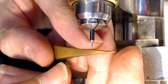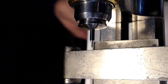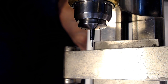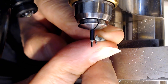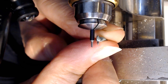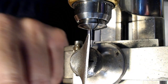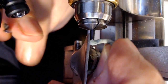So, I dropped it, but the good news, it's on the plastic thing back here, so we're good. So it's done there. That's two parts done. So I got that part, I got the hairspring part, and now if I measure this, have a look at this, and look at where my line is. I got way too much metal on the end there, so I have to take this down a bit. So what I'm going to do is mark where I think I need to take it down, because it's way too long. Normally I don't make it this long, I just make it very close.